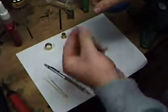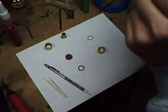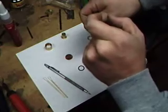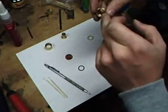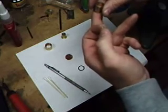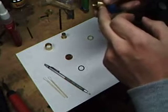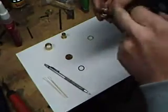What we're going to do is take our lens and take a look at it and try to find out which side the bevel is. On the higher powers the bevel isn't that great, so you can flip it over a couple times. The side that's countersunk is the side that will be inside the scope. This is the objective lens so this will be on the front of the tube, and the flat side will be facing away, giving a nice clean look. There's also a small groove we've placed in here for locating your screws so that you're not drilling into your lens.